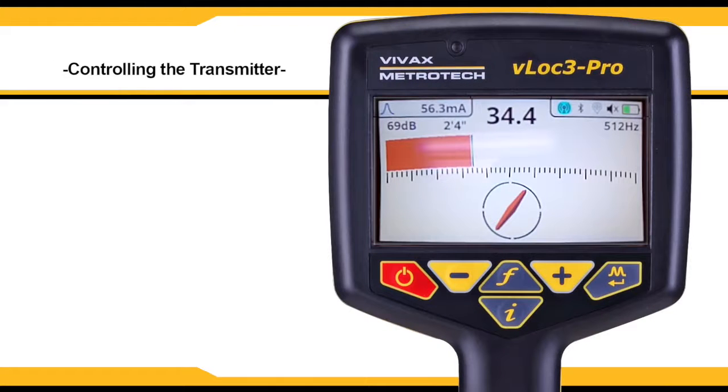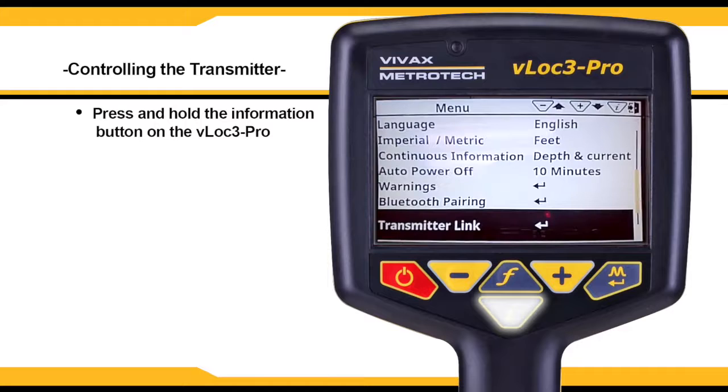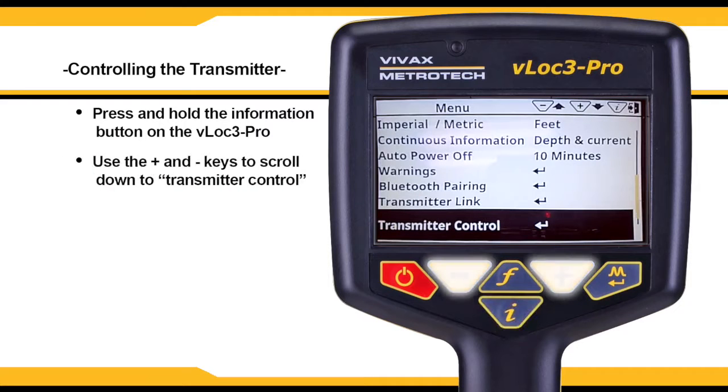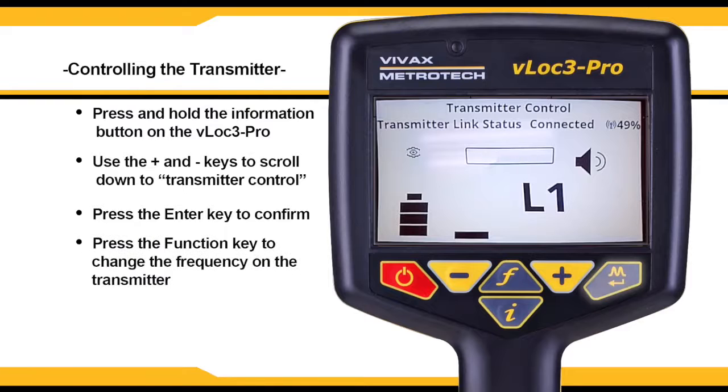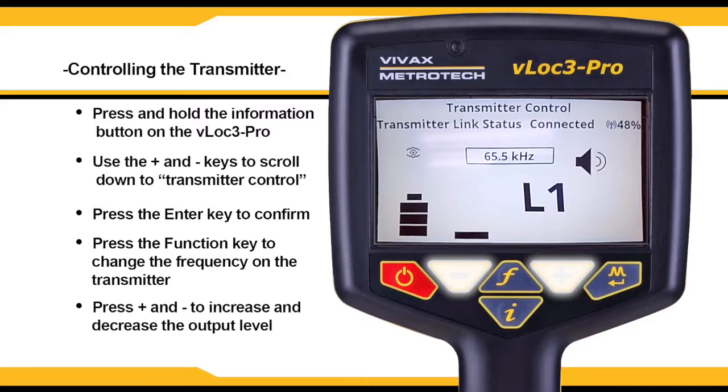Once the vLoc3-Pro is linked to a transmitter, the user may use the receiver to control the transmitter. First, press and hold the I button on the receiver. Scroll down to Transmitter Control and press the Enter key. You will now see the Loc3-10TX screen appear on the vLoc3-Pro interface. You can use the F key to change the frequency on the transmitter and press the plus and minus keys to increase and decrease the output level.